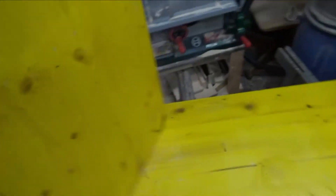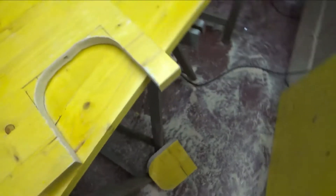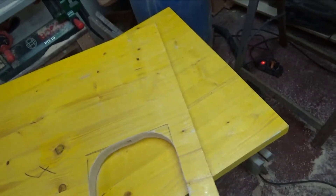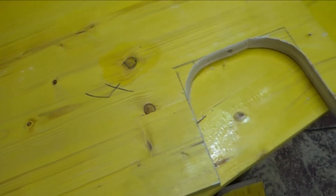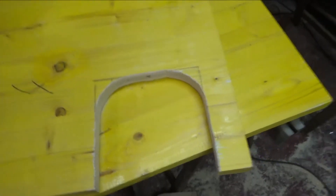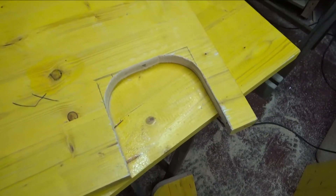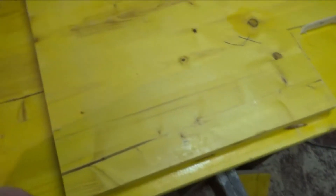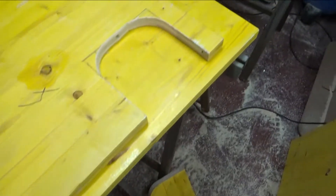I think that should be a big enough hole without being too big. I'll just nip round it with a rasp to knock the high bits off. What I'm going to do now is fit this together and screw it up — it could be a temporary thing just to make sure everything fits and it's going to go where it needs to go. When I finally fix it I'll caulk it as well — caulk it and screw it, or glue it and screw it.